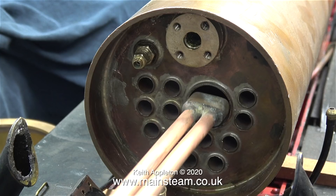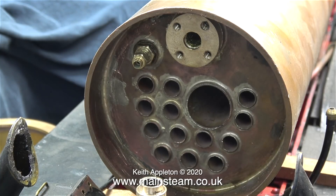One more time: the superheater element does not go through into the firebox, so it won't be glowing red, the silver solder won't melt, and even if it did, the pipes are threaded into the block. If I'd wanted to make a superheater that went into the fire I would have used stainless steel welded together at one end. I hope this clarifies the situation.